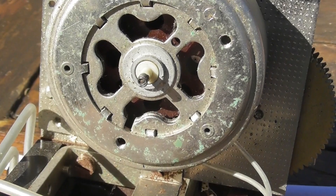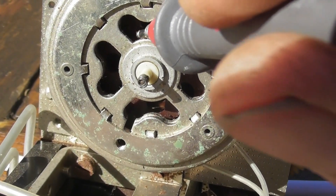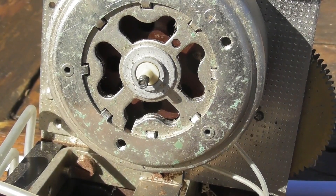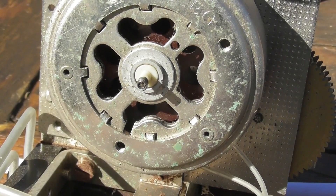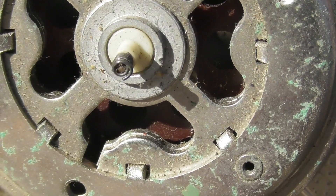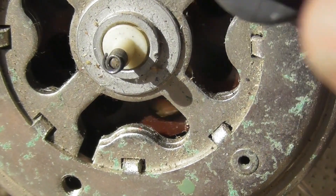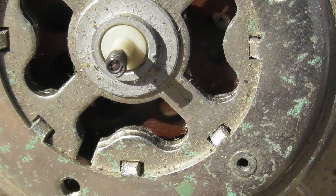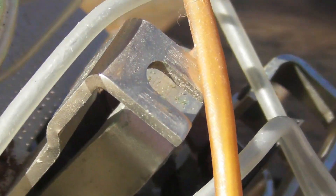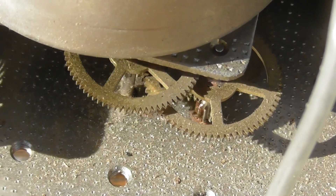I have an energized device. Looks like this one is also seized — see if we can give it a little hand. There we go, it's turning. Also dried-up grease — this one needs cleaning up. Camera picks it up nicely. Nice smooth running. It stopped again. It needs a little bit of maintenance here. A little bit of protest from the other side — let's have a look. This clock has problems. I think there's too much end play on some of the gears — that's why it has stalled.